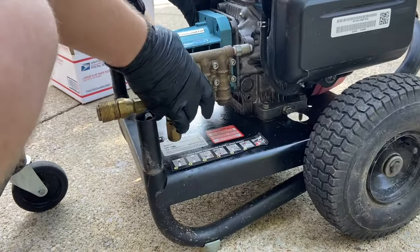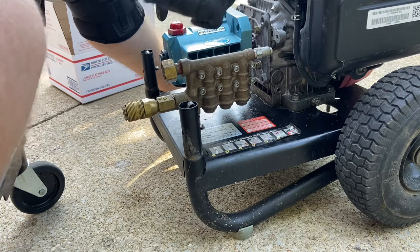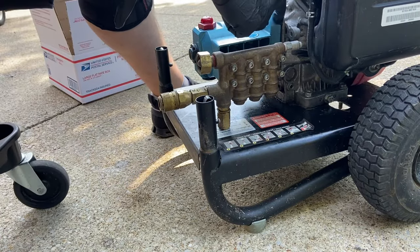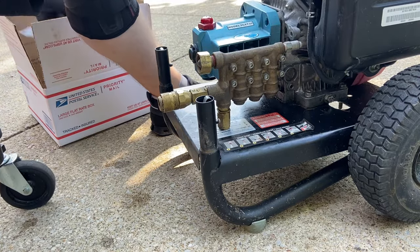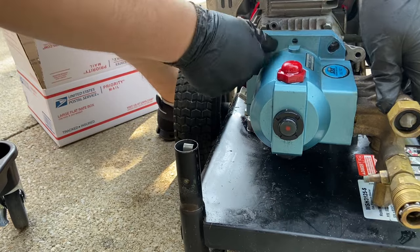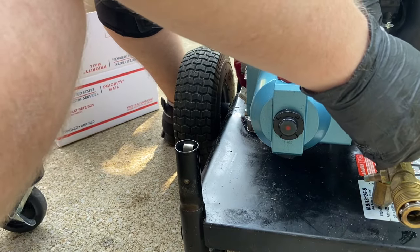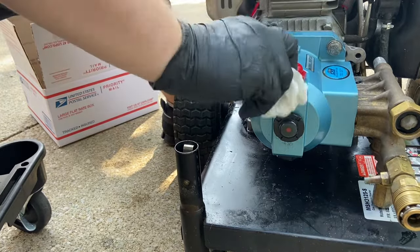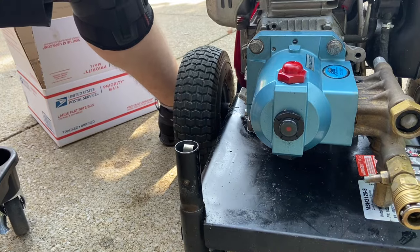Because if you twist the pump it'll start leaking oil. I've had this happen on CAT pumps before — it's actually the location of the key; it's too long. That's why I was banging it to move the key further that way. Now it's all the way because the faces meet here. If you try to tighten these bolts up while there's a gap, you'll bend this aluminum plate or you'll snap it — and that's what happened with this one. I was a little disappointed this pump wasn't rebuildable. It wasn't the unloader — I figured it was going to be a simple fix.